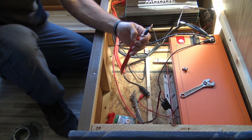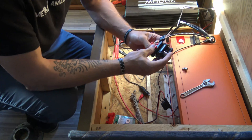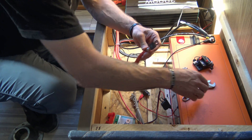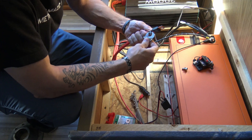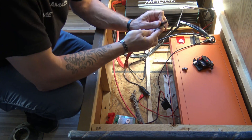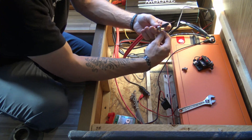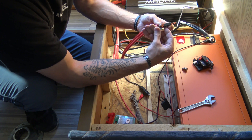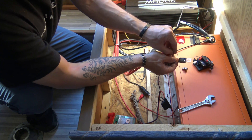On the positive side I'm going to add a 200-amp breaker, and I'm also going to add a fuse — so it's kind of a double protection. We'll have the circuit breaker and also a fuse. You technically don't need both; I'm just over-killing it a little bit. The main purpose of the circuit breaker is so I have a way to turn the power on and off from the battery to the power inverter.